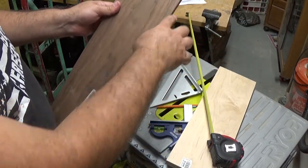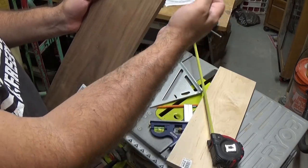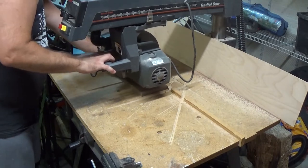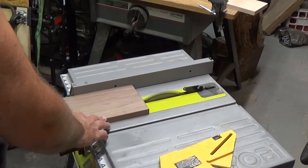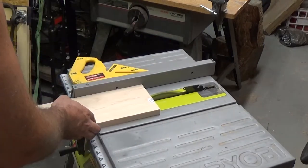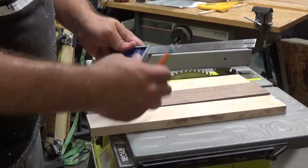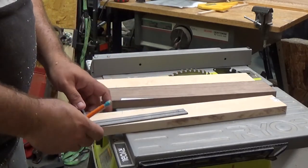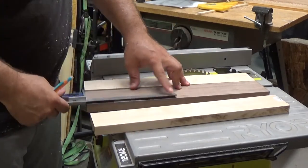I really don't want to waste any wood. We know we have eight inches square on each side, so I went to 17 inches — eight times two is 16 plus an extra inch for grace. I'm going to cut it here and save the rest for another project. First we'll cut our walnut centers down to three inches wide, set the table saw for that, then we need two strips of two-and-a-half-inch wide maple. So we want to measure out to eight inches and set our combination square to eight inches.